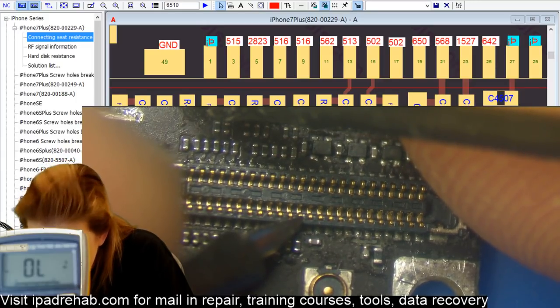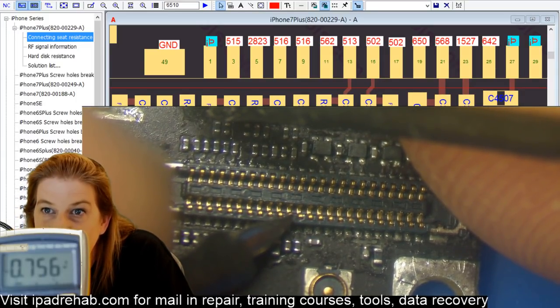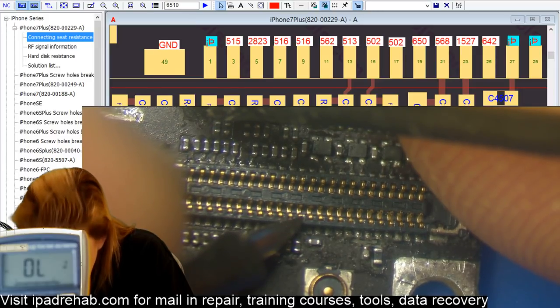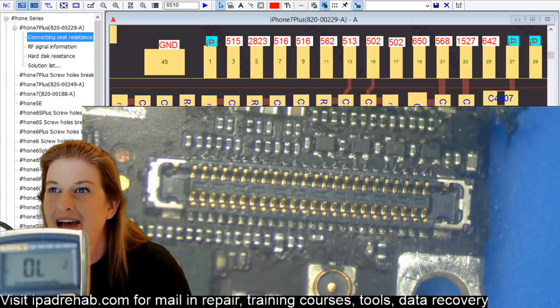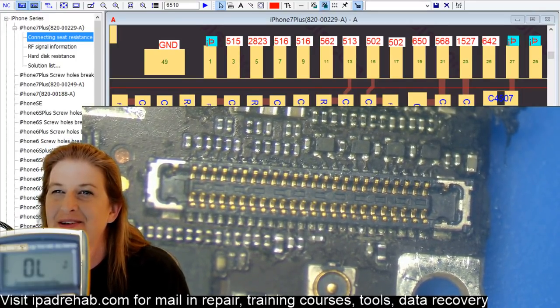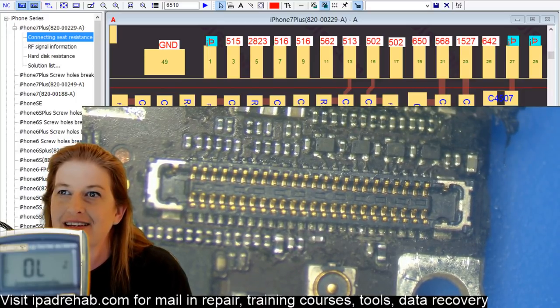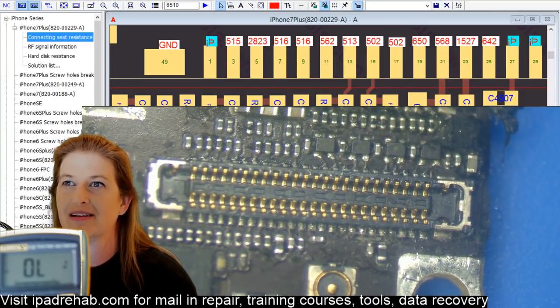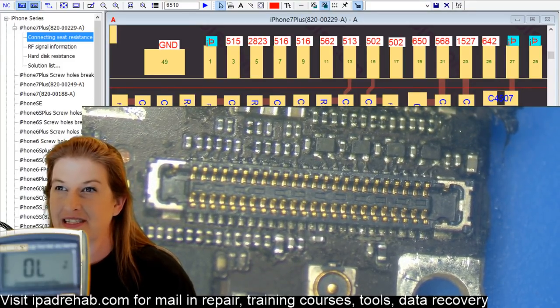Counting to pin 12 from the top row — pin 12 is OL. ZXW shows 1.5 for that position, meaning 1500, so we'll call that pretty much OL. Then there should be two pins that are a little higher before another OL. Checking the 10th pin: 0.536. Pin 11 is higher. Then pin 12 in the bottom row: 1.48 — almost an exact match. Next: 0.601; ZXW says 642 — close enough. The next two should be OL, and they are.